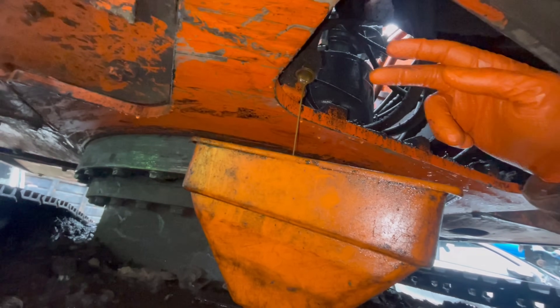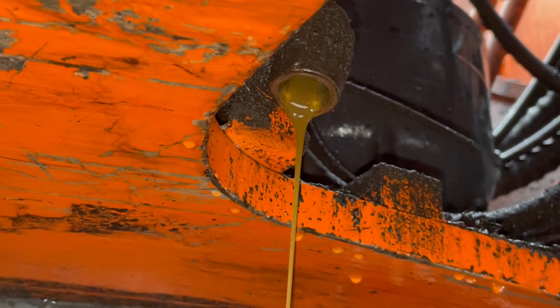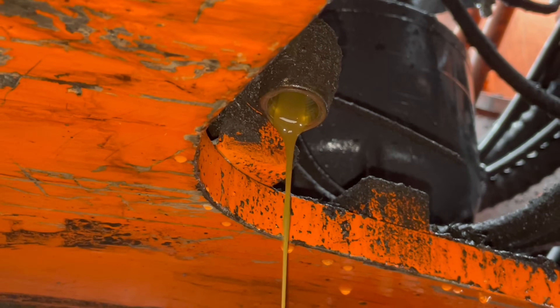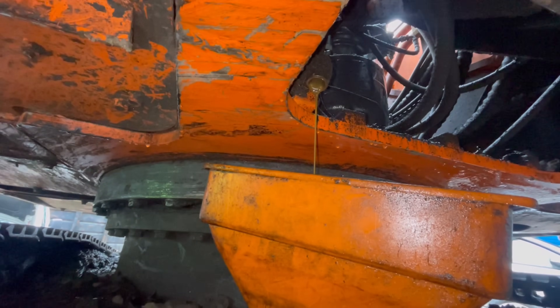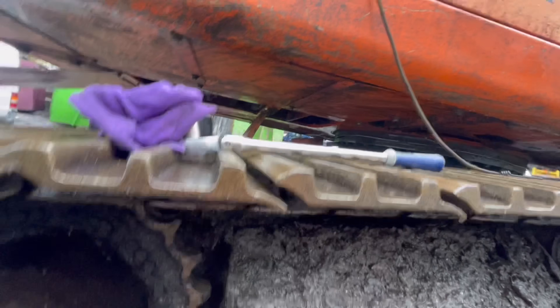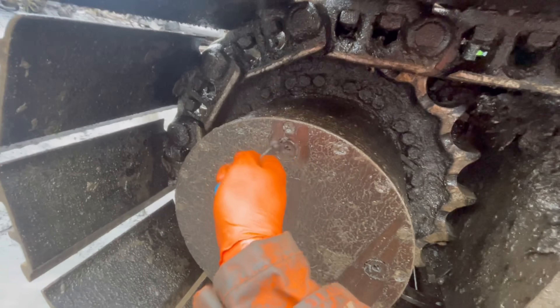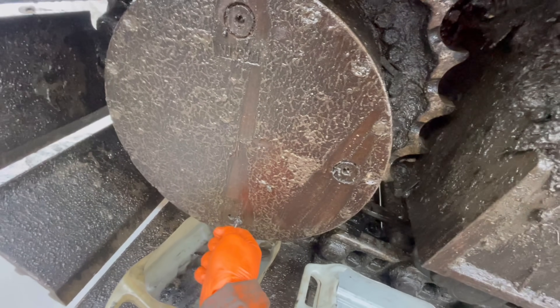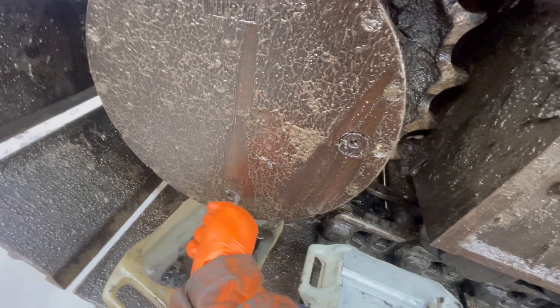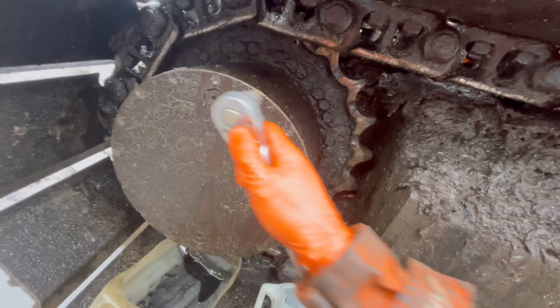When you fill the slew gearbox oil you fill this bit of pipe and this bit of pipe, so the gearbox oil won't really mix in with what's in the pipes at the moment — it looks lovely and golden. I'll come back in ten minutes and see how it looks. I'll take the filler neck off to help it run out quicker. Okay, that's draining out. I want to use those drums for the engine oil as well, and get these hubs draining. I think the oil will be all right but may have a bit of colour about it since it might not have been changed for a while.